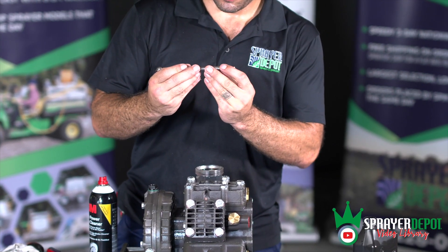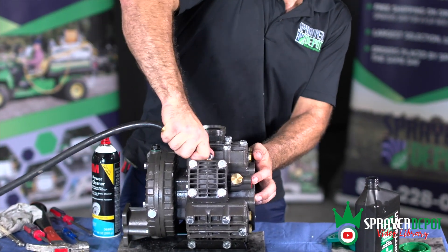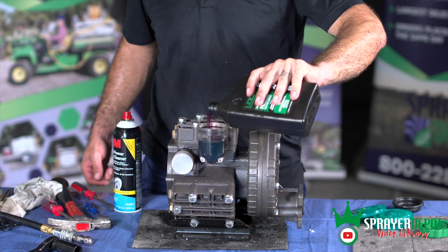If you have too much or too little psi in the dome, your discharge lines will pulsate and jump around. Check the oil sight glass — you will see it has bubbled down some and add more oil if needed.